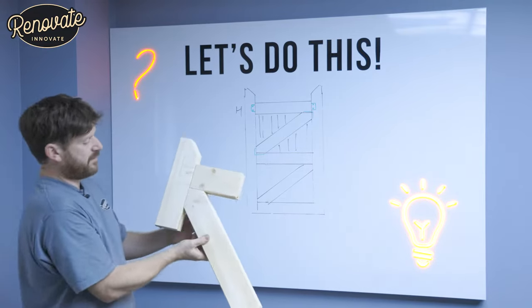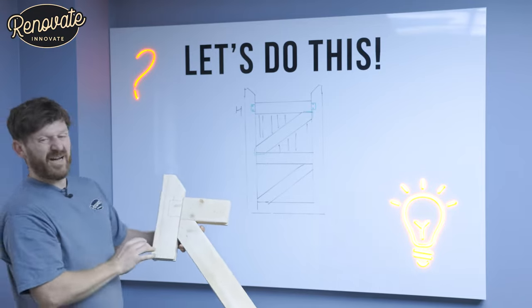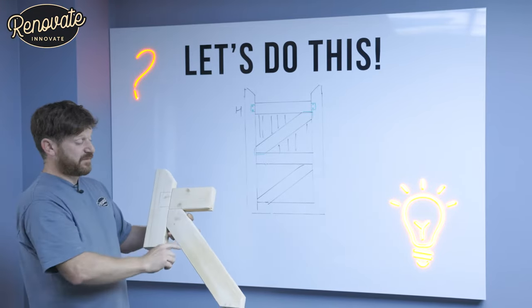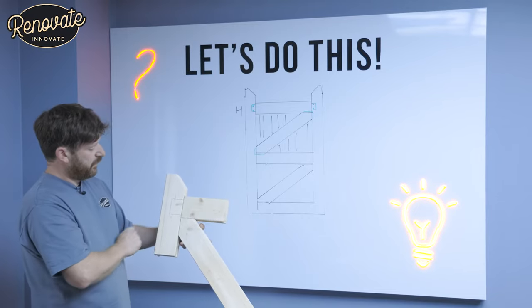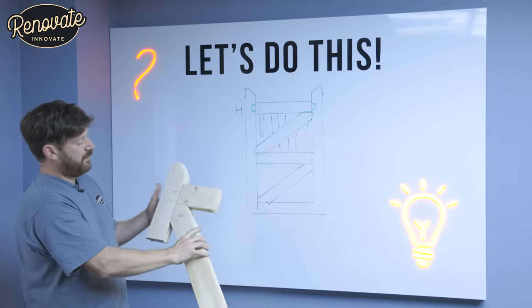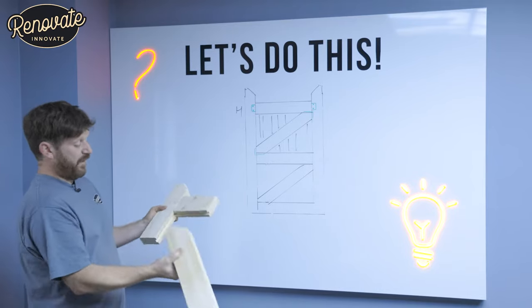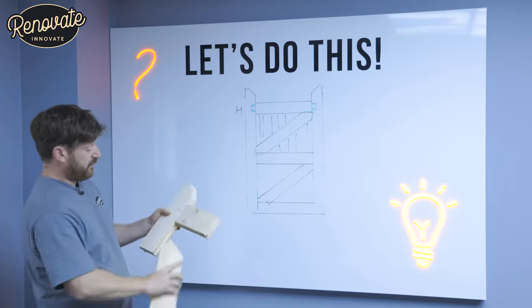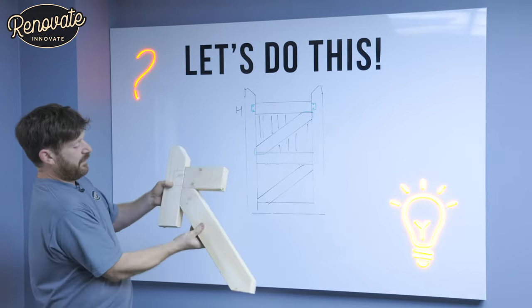A little mock-up here of the size of the timbers we're going to be using. These are 4x2 timbers, PAR or PSE — plain all round or plain square edges. This has got a few knots in, but we don't mind. The mortise will be going halfway in. If we didn't have this brace with a mortise on it, it would just float — it wouldn't have any strength. So we're going to add that in there and that will help hold it together.